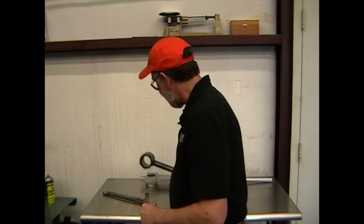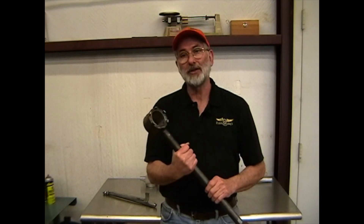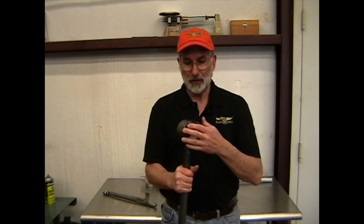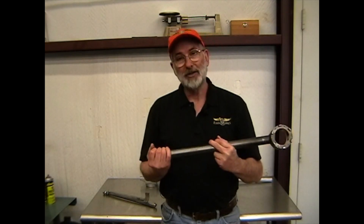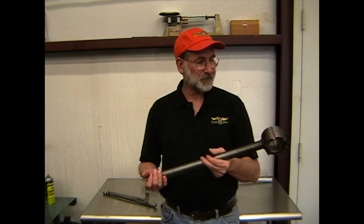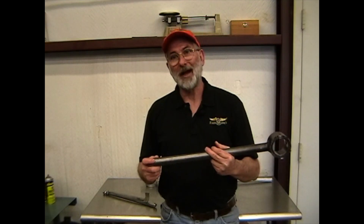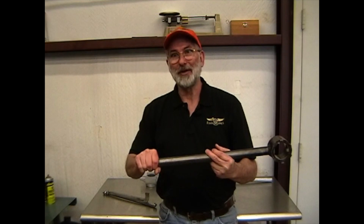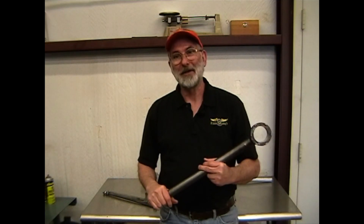The third tool I have here is the crankshaft thrust nut wrench. This one is necessary to tighten the crankshaft thrust nut, which is one of those nuts you're supposed to be inspecting — it has splines on it. There is a specific torque for that nut, but obviously this isn't a torque wrench, so how do you do that? Well, if the torque value is 450 foot-pounds and you're a 225-pound person, you grab it at 24 inches — that's 450 foot-pounds. Lycoming actually made a chart so you didn't have to do the math, and they put that in one of the military maintenance manuals. The thrust nut wrench is a very good one to have.